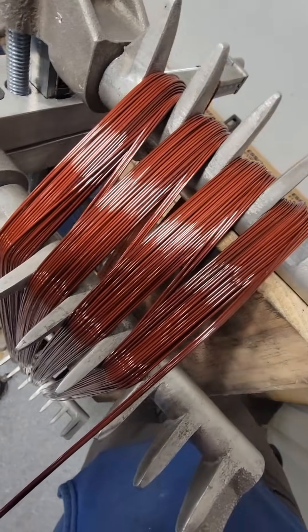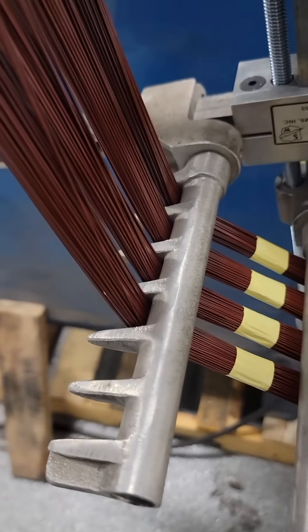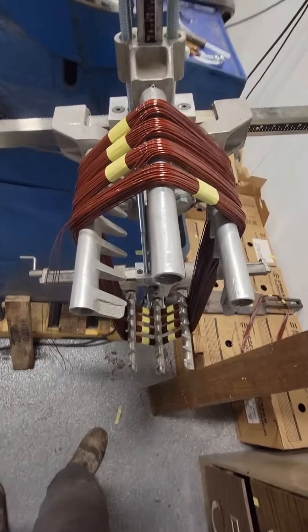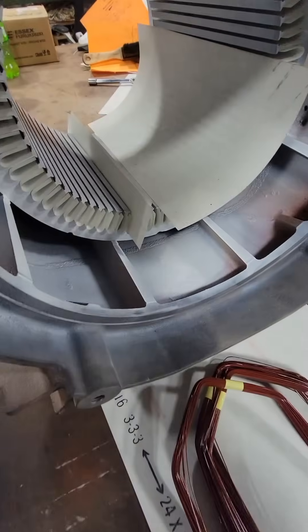This motor has 18 groups of four coils — 18 times four is 72 — that's what's going to occupy our 72 slots. I recommend you tape these coils as close as you can to that center knuckle so that you can get those wires to spread apart; it makes them a little bit easier to get into those slots. We want to be careful with these wires — we don't want to scratch them. They are enamel coated, and if we do scratch these we have the potential of having a short.